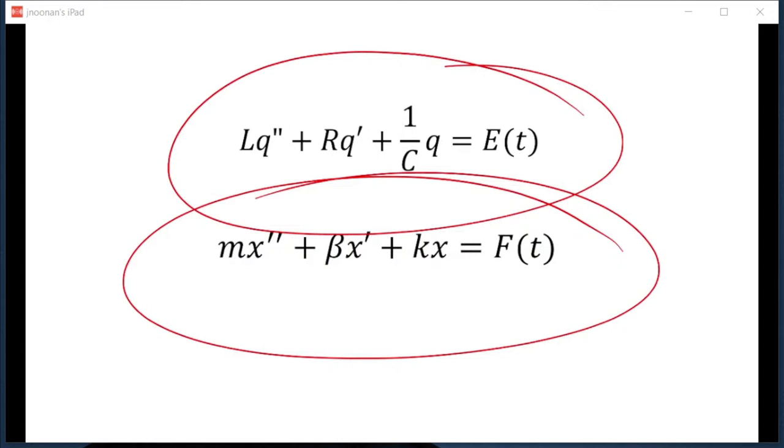It's a little harder to show you the forcing function in an LRC circuit like the light bank up here. Right now, there's no energy being added, no voltage. In just a minute, I'm going to add a sine wave or something akin to a sine wave. And there it goes. It lights up, but you can't really see what's going on up there. So that's why I like the spring mass system. But all of the differential equations are the same.